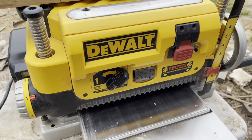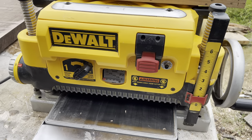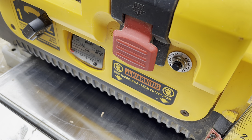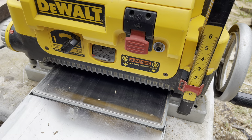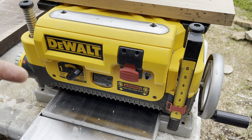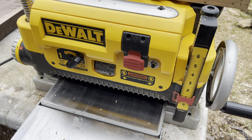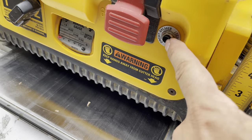If you're like me, you own one of these fantastic DeWalt 13-inch wide planers, and you might have an issue sometimes with this little circuit breaker constantly tripping for various reasons. Number one, odds are you're running the planer, which has three blades, and they're dull — the full-length, high-speed steel blades. When they're dull, the motor's going to be bearing down, get overworked, get heated, and it's going to cause this circuit breaker to trip.